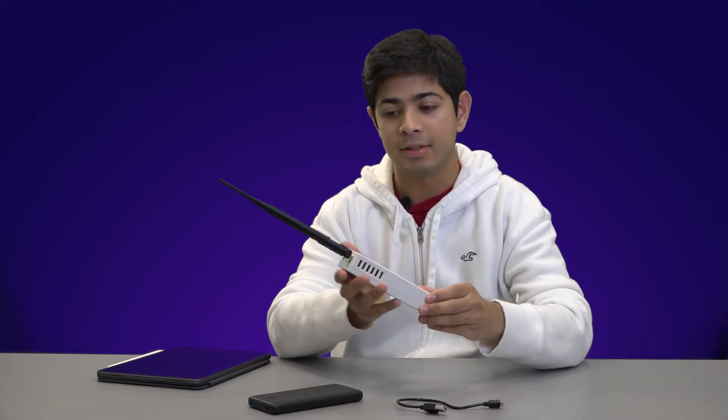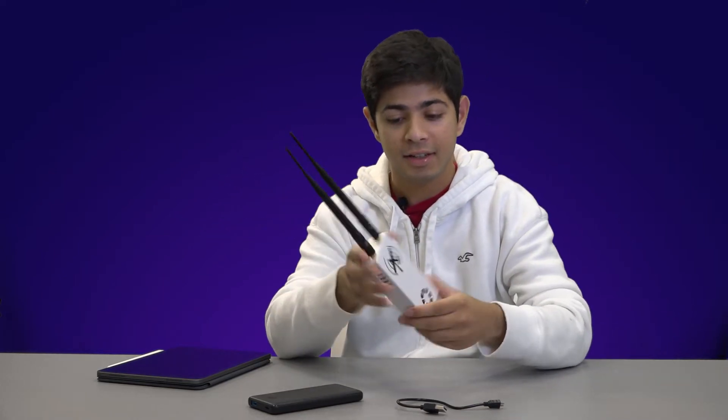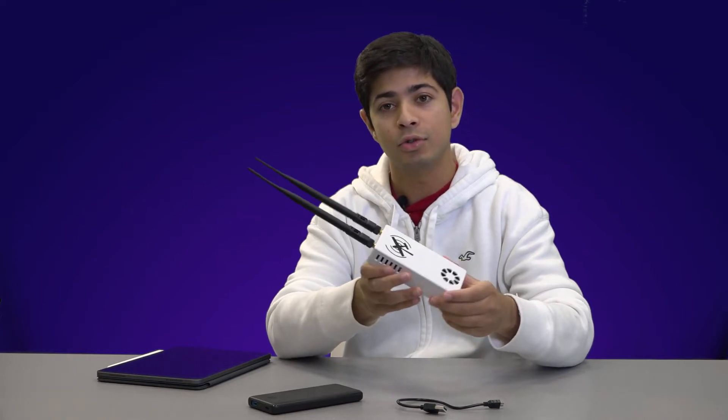It's basically a tool that you build yourself using a Raspberry Pi, some software-defined radios, some antennas, and a nice case to essentially receive signals from other aircraft and from ADS-B towers on the ground. It allows you to get a lot of data into your plane that you wouldn't otherwise have unless you have an ADS-B receiver built in.